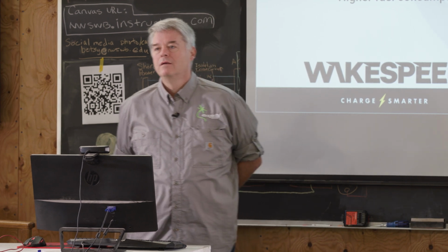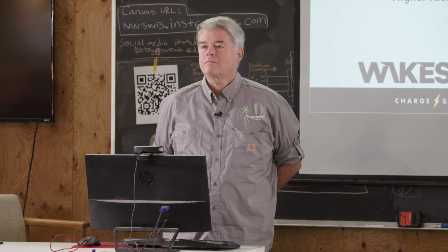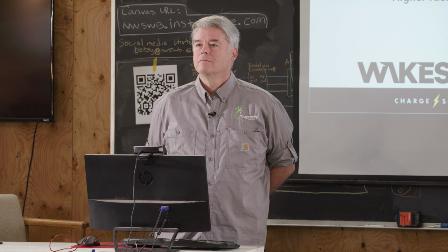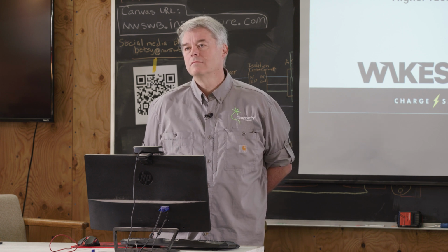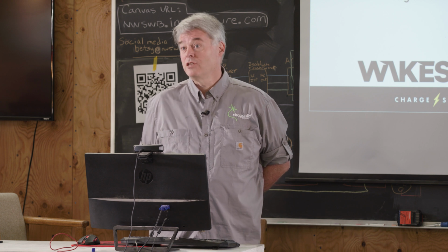So, engineering inefficiencies, no one's going to have control. You can say, oh, well, I've done a load assessment, and I've interviewed you about your use pattern, boat owner number one or whatever. And based on that data, from an educated place, I can choose the optimal generator, but I can't overcome the inefficiency. You'll never overcome that, and it's because it's a fixed RPM.